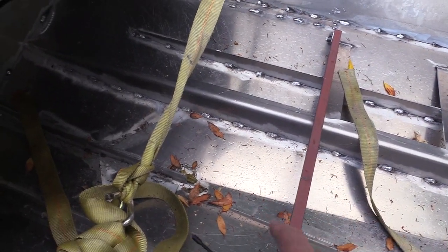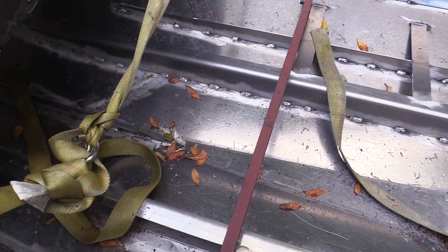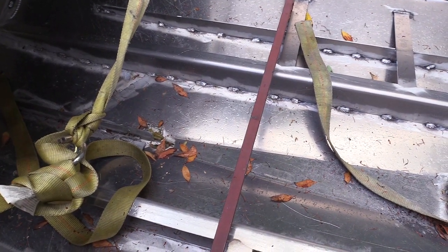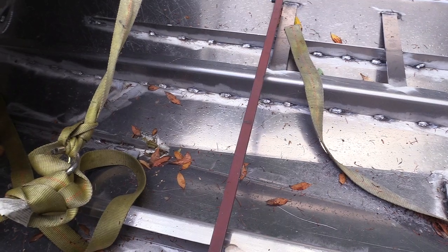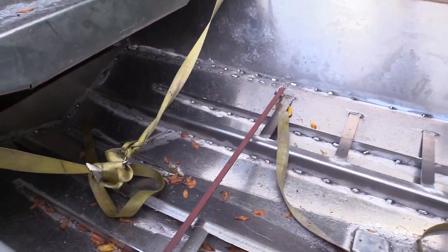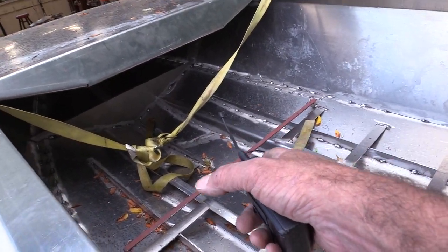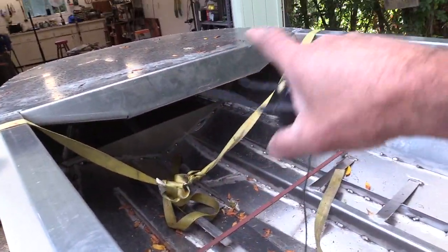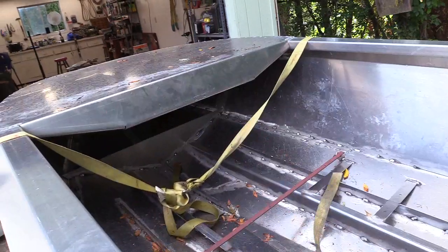You're talking about literally making a jig to try and get in a press, and the jig being stronger than this metal, obviously, and trying to conform that keel to your jig and rebend it and conform it to the right shape from front to back. This is RSR, this is RS Racecraft. This is their bends. And the problem is right there. That's why this height difference. That's why the boat's twisted and higher on one side. It starts at the keel and it carries out all the way through the whole build.